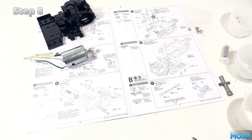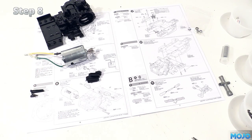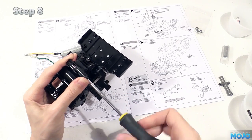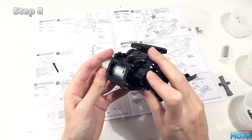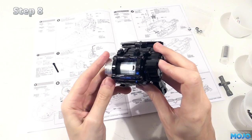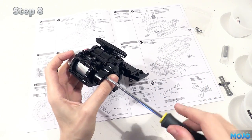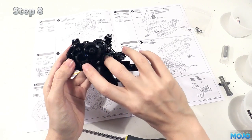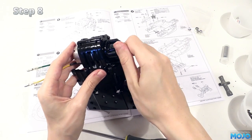Next, step eight. We'll need the two A7s — the best description would be body mount mounts. There's two M3x25s and two M3x10s. First the body mount mounts fit to the side of the gearbox; they've got little blocks on the end that locate them, so you install one of the M3x10s on each side and they'll line themselves up. Motor next — slot it in roughly the right position, getting the holes roughly lined up with the middle pair of holes on the gearbox, the middle pair being for the 16 tooth pinion you get in the kit. Pop in one of the M3x25s and lightly press it against the face of the motor; jiggle it around and you should feel it drop in when it finds the hole. Pop in the other screw and move the motor until it finds its hole too. With everything in, tighten up the two screws nice and tight — steel screw threading into a steel motor.